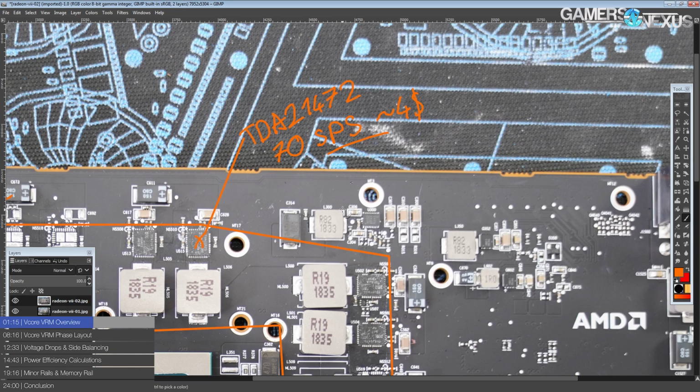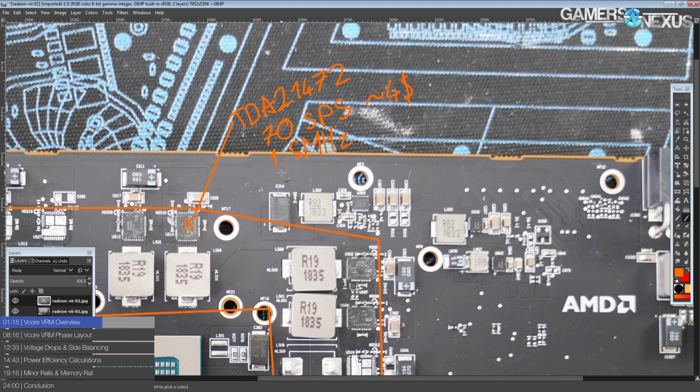Which makes them a smart power stage, but because these are also made by International Rectifier and extremely expensive, they also come with features like they can run at switching frequencies as high as 1.5 megahertz, whereas the FDMF 3170s, which NVIDIA likes to use, go only up to 1 megahertz. Not that that's a particularly useful difference, because most of the time you will never run your voltage regulator at that kind of frequency. It ruins your efficiency.